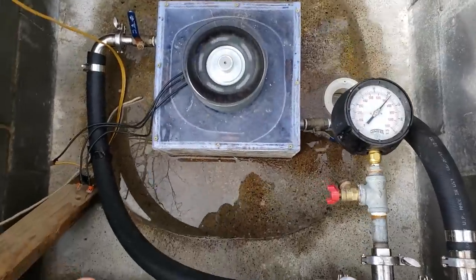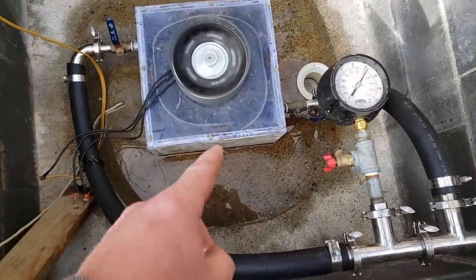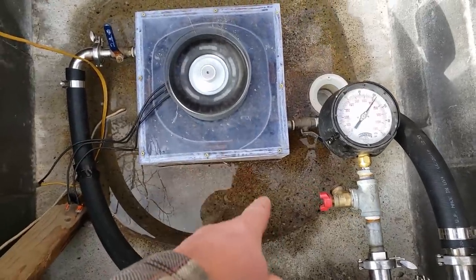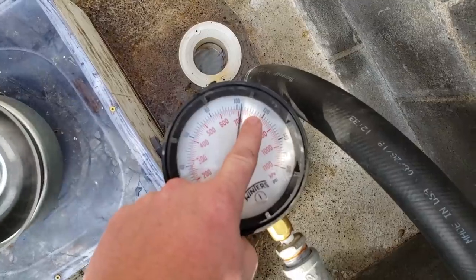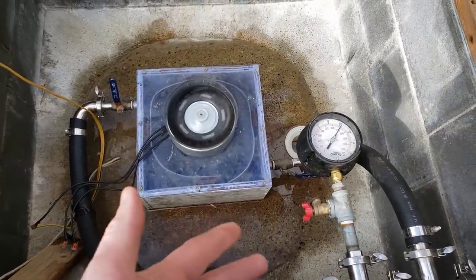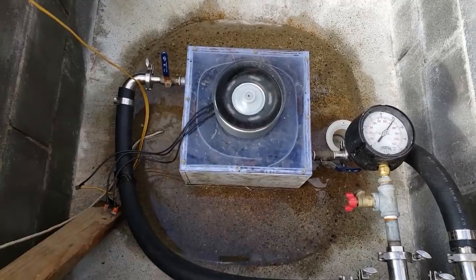About a week later now, I've also been working on some smaller nozzles. I've been trying to take advantage of this lower flow that I have right now because we've had a really dry summer and fall. I just don't have a whole lot of water flowing. That one nozzle flows maybe two gallons per minute by my calculations — I should actually measure it with a bucket and a stopwatch. But I'm already draining the supply of water with that nozzle that only flows two gallons per minute. Normally it'd be up at 117 PSI, but it's already decreasing. And even when it was full, that alone is not enough to power the charge controller — the charge controller will actually use more power to operate than this can put out. So it's a net loss, unfortunately.